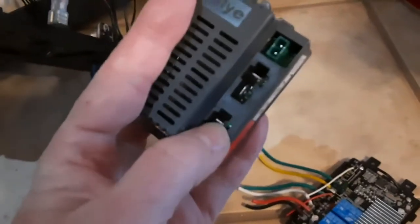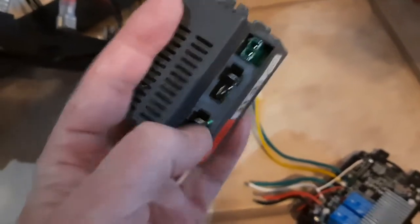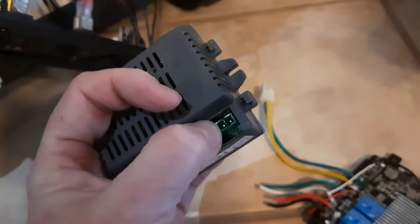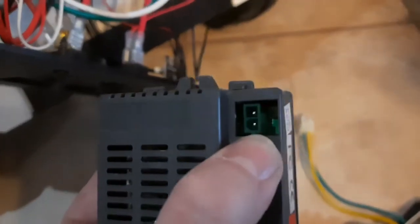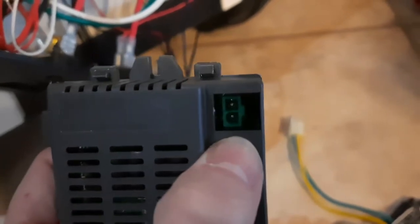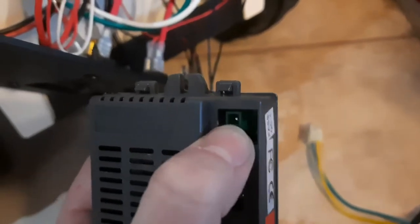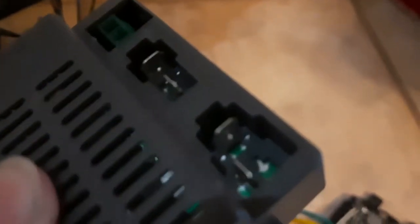Basically power plus on top, ground, and your motors so you can orient them whichever way you need to go. For the steering connector, I couldn't find the exact name for it, but I had some RC car stuff and dug through the box and found a Tamiya mini connector — it fits in there nice and snug even without clicking. I used standard spade connectors with plastic covers to help them not arc with each other. If you wanted to find the exact right connectors you probably could, but I've got a big box of parts and it works fine.